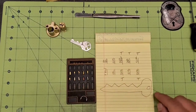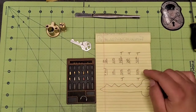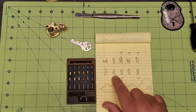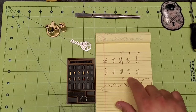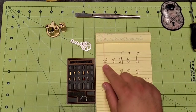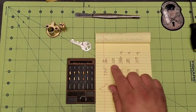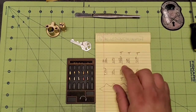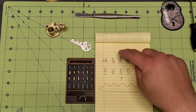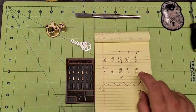So going across, and then I drew this to help keep it orientated so that I know exactly how it's going to go into the lock. But basically on this, starting on the end here, we're going to do a T-pin and then a spool and then a serrated and then just a standard leave it alone pin and then a serrated and then the drivers. I'm going to do a diamond spool, or what I call a diamond spool. You guys will see all of these as we make them and go through the process. And then the top one, or the next one's a standard, and then a serrated T-pin, and then a serrated spool, and then a serrated. And then in the Bible, I'm going to thread the first three chambers, and then in the core, I'm going to thread the first and the third chamber.